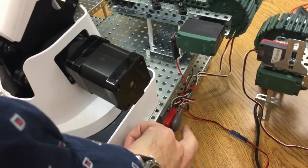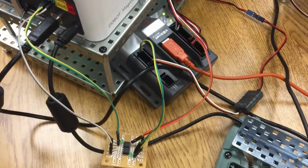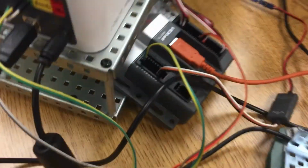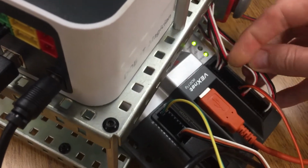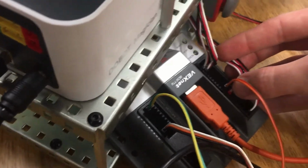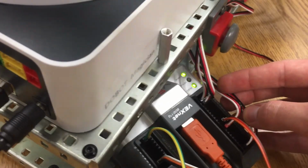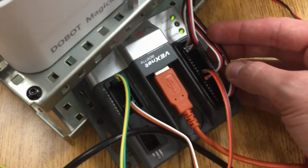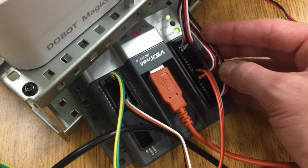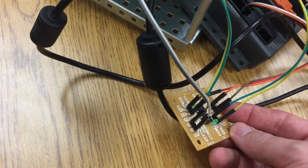Yep, limit or your bump switch. Okay, so then it just goes into 2 outer pins there. I see, and I can see that. You got these, are these all in port 3? It looks like, yes. The middle one doesn't technically have to be there on your digital pin. The middle one actually doesn't need to be there, but on the outer 2, you got those plugged into the digital, and that comes into here. And it doesn't matter the direction.